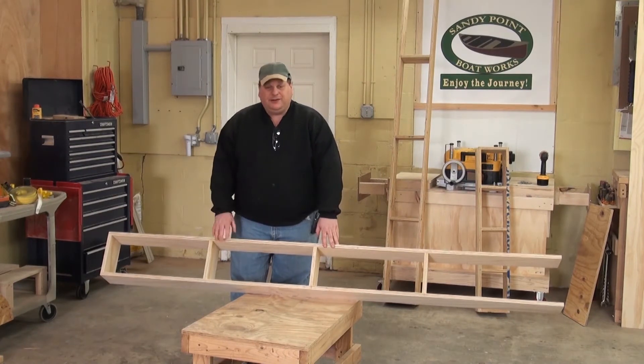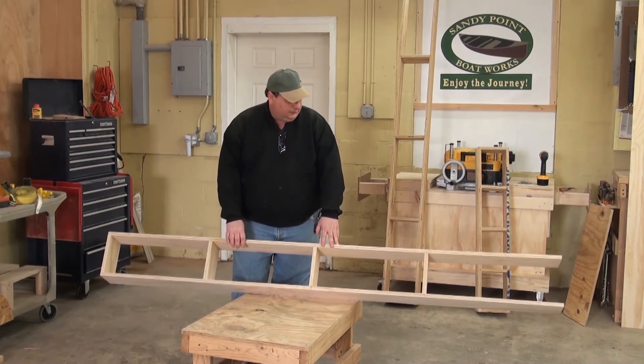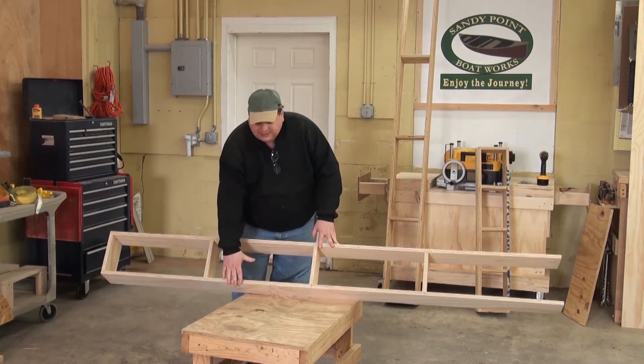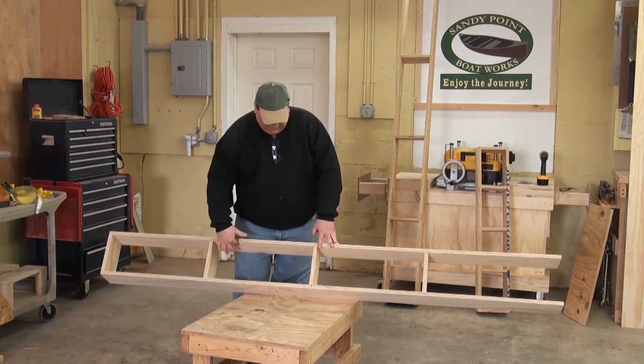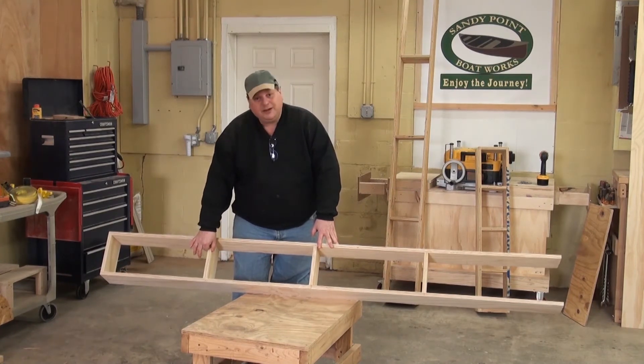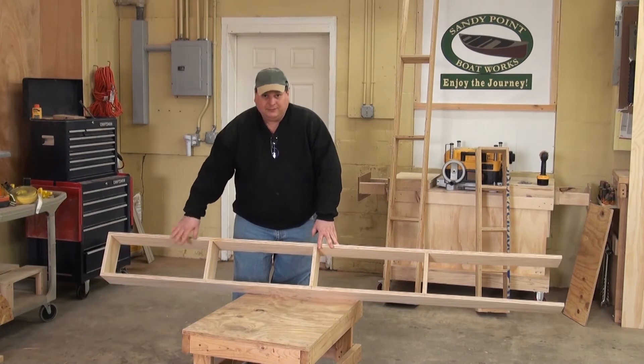What I found the best way to do that is use decent three-quarter inch plywood. This one is ripped down to eight inches. From here to here is 10 inches. Inside here is 10 minus an inch and a half, which is eight and a half inches. I've got these spacers spaced about every 16 to 24 inches down, and then two sides capped on the end.